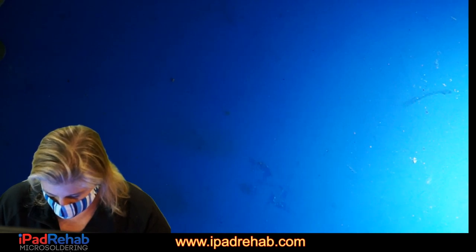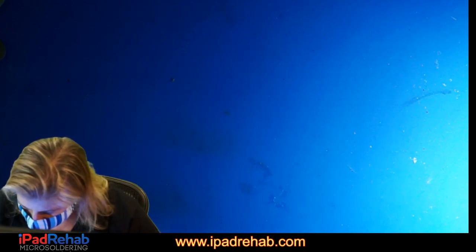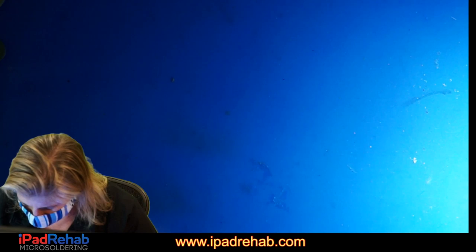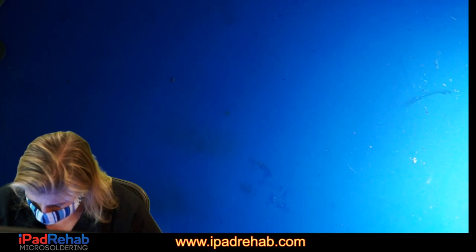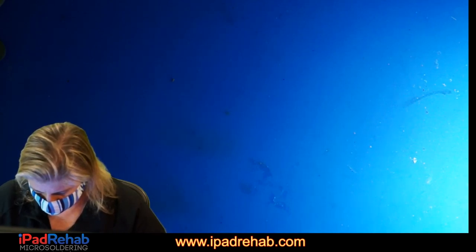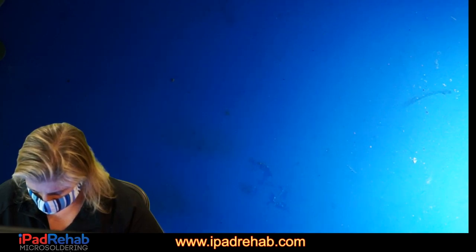It's hanging at 242 milliamps after having prompted this poor thing to boot, with a 140 degree spot within the PMIC, which is really not that hot at all. And we're looking for any other clues or signs of heat at all to see where it is spending that extra energy. Nothing at the bottom of the board. Nothing looks hot around any of that.